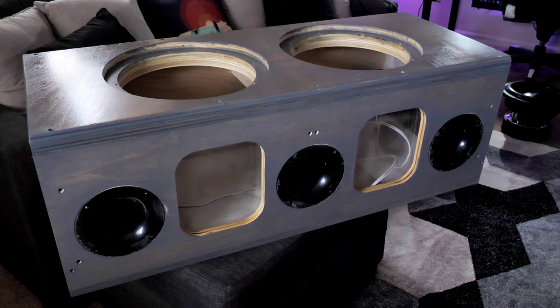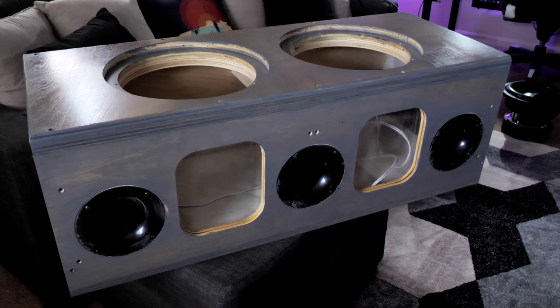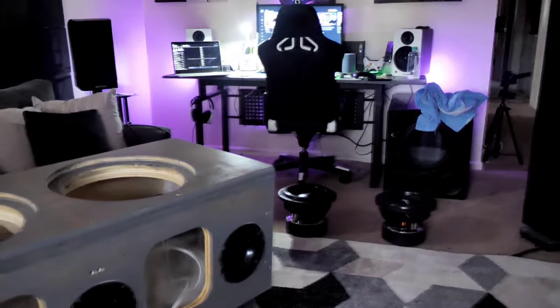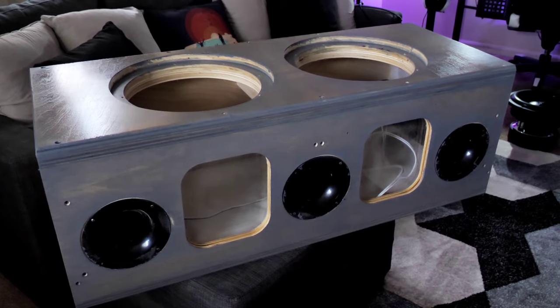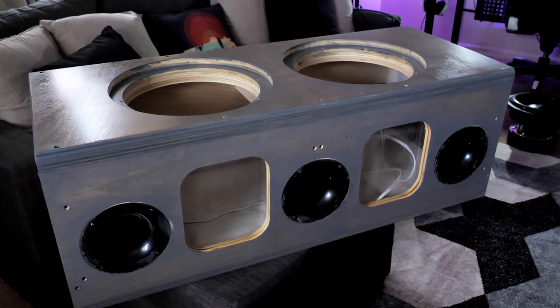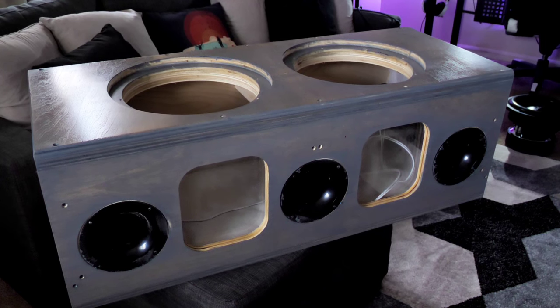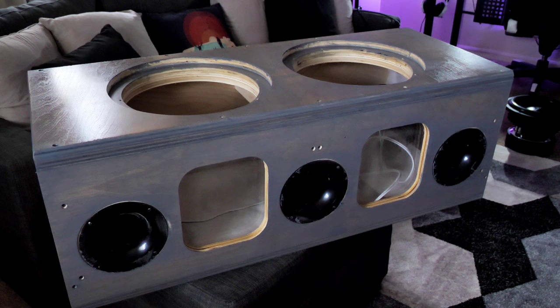The box is done. What I did was sanded it down completely with 220 grit sandpaper, made it nice and smooth, cleaned it up, then went in and added a wood conditioner — because birch wood does not do well with holding stains, especially darker colors, since they're more susceptible to blotches and dark or light spots. I used a grayish light gray color, the same stain I use on my desk. It gives a bluish hue and kind of a two-tone look. Not the best finish, but I don't care because it'll be in the back of my trunk and dark most of the time.